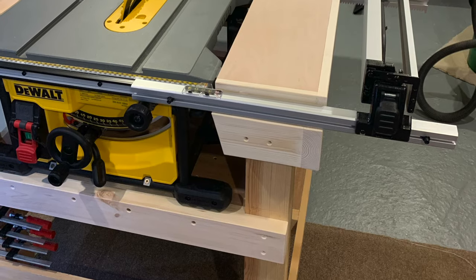It's a cross-cut sled as you all know, and it fits in just here. Now it has gone a little bit stiff, so what it tends to do every now and then — a little bit of machine wax. You can buy this anywhere; I tend to get this one from Axminster, it's very good. Just a tiny little bit on some blue roll — it really doesn't need much at all. Just a rub down each side, and you will see a nice difference.